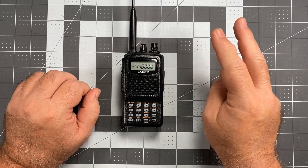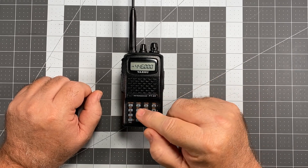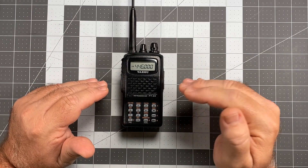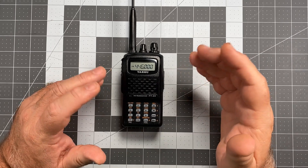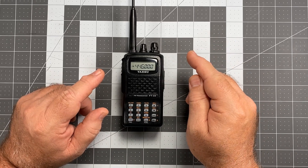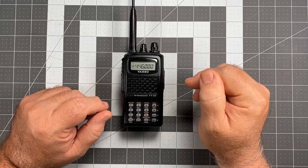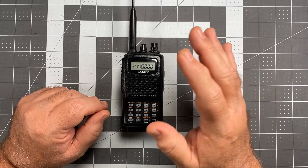What we're going to turn off is Automatic Repeater Shift. What Automatic Repeater Shift is supposed to do, if it works correctly, is that from VFO mode, if you punch in a frequency associated with the range set aside for repeater operations within that band, the radio will automatically apply the relevant negative or positive offset. You can begin operating the repeater right away — all you need to know is the receive frequency. Punch that in, it drops the offset in, and you key down and start operating. If it works right, you can save it into the memory system, name it, and you're good to go. If it worked correctly, this would be an awesome thing.